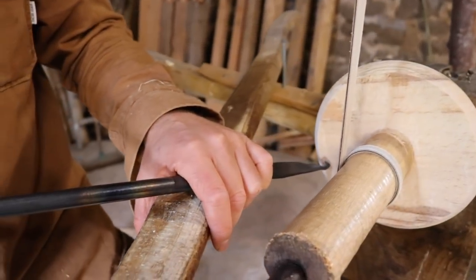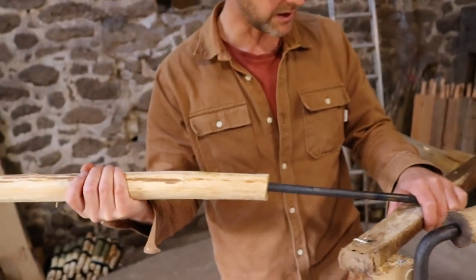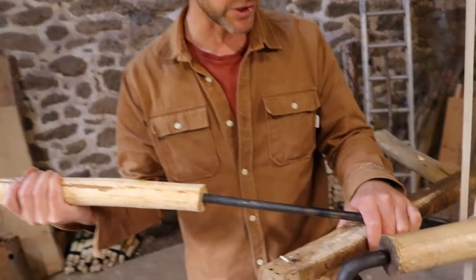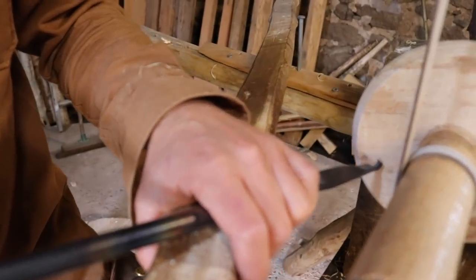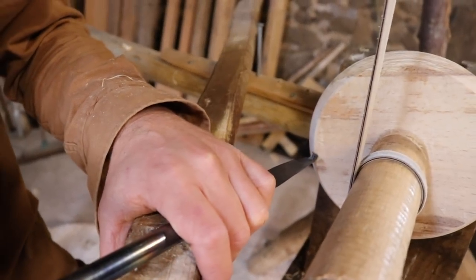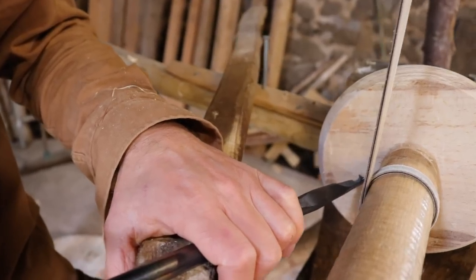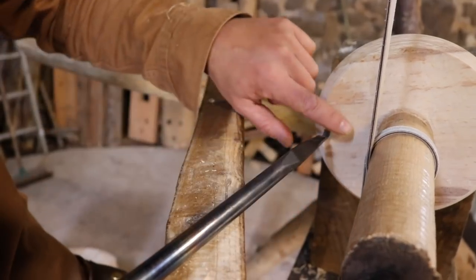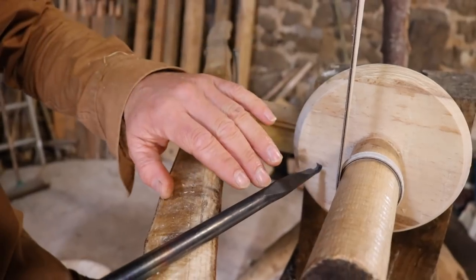And I say usually start at this edge, have a little sweep like an arc, still working in arcs, a little arc like that just over the edge. And once I've done one pass over the edge, a small section, I'll move the tool back towards the centre of the bowl by a centimetre or so, and have another pass over that whole section that I've just done until I come right off the edge, and move it back again a centimetre or so closer to the centre of the bowl and pass over that entire section. And the reason I'm passing over the entire section is just to keep it flat and uniform. If I just do lots of little sections, I'll have lots of ups and downs, you know?